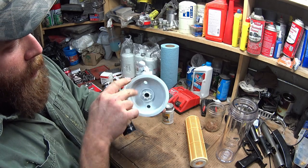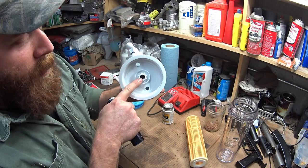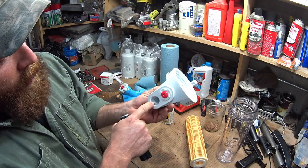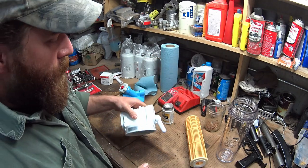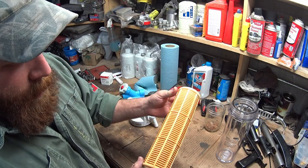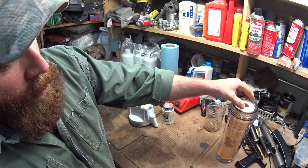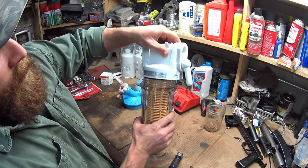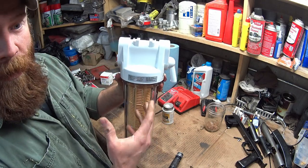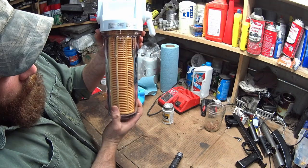That port is unobstructed on the way in and unobstructed all the way into here. Once it goes through a sediment trap and goes through here, it starts to go back up — your water is also uninhibited, no Gore-Tex or any other film or screens in there — and it goes right back out. So this guy's going in today and should solve my problem. This is just a regular old sediment filter; you drop them inside and then the whole shooting match goes together. Hang it downstream from your hot water heater — water runs in here and sediment collects in the bottom.